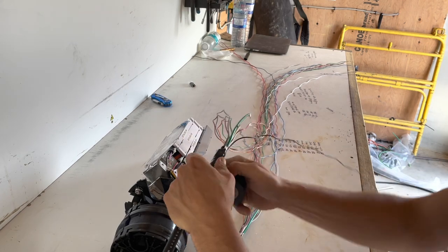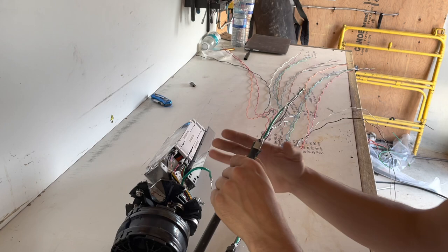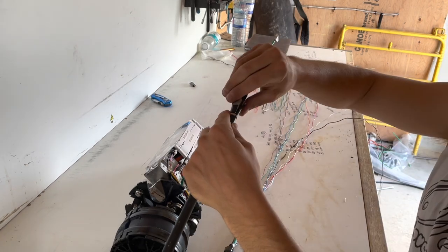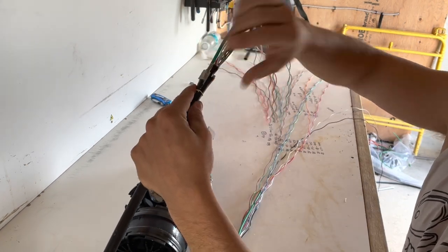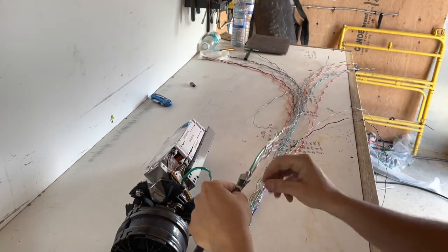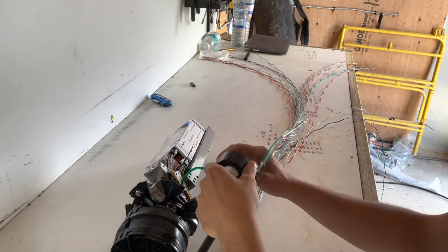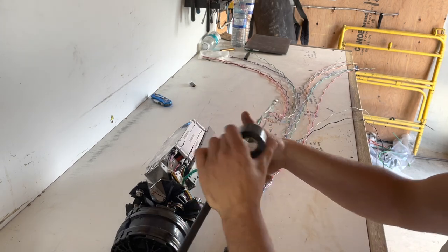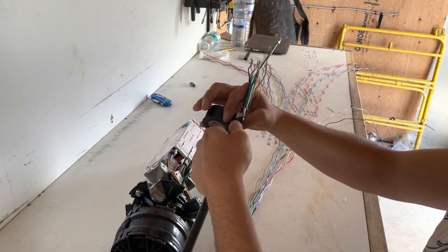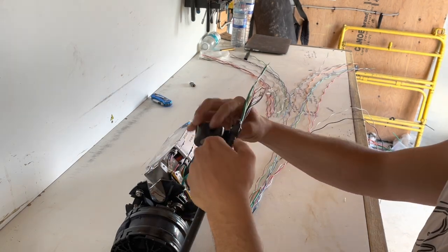But it was all because when the guy put the ground on, his bond clamp, he cranked it way down too tight, right in there, boom, flattened those tubes inside of under this little plastic coating. There's not much in there protecting those tubes. And so you're just gonna get in here nice, snug, where you're not cranking down on it.